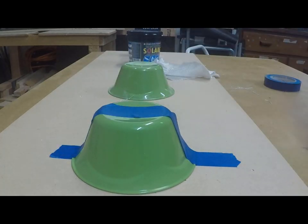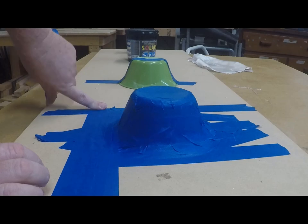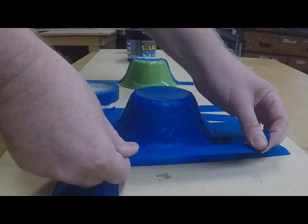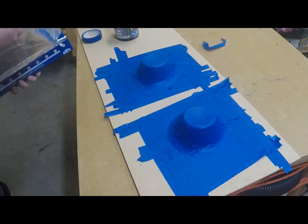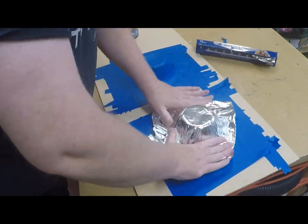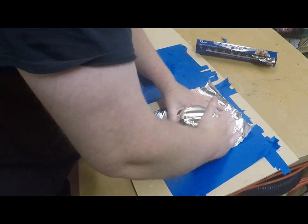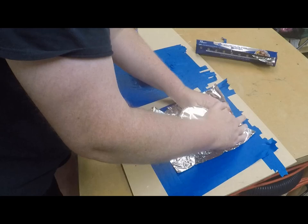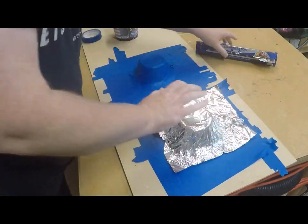Speaking of the mold, these are just cheap plastic bowls that I grabbed from the kitchen. If I do a good job with all the masking tape they won't be harmed in the process and I'll have them back in the kitchen cabinet before my wife even notices they are missing. I'm going to lay down some foil. It's also good practice to use some mold release wax. I don't have any so I'm not going to be using any for this test, but I'm definitely going to want to use some when I build the actual subwoofer enclosure. Make sure you subscribe to the channel so you don't miss that subwoofer enclosure build.